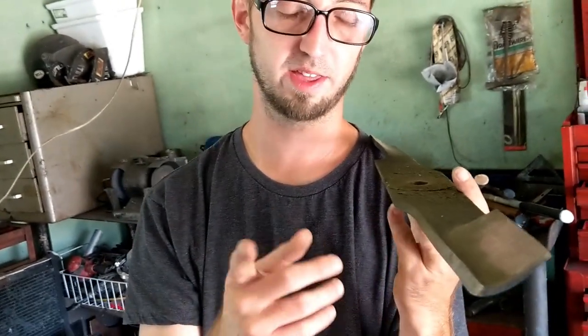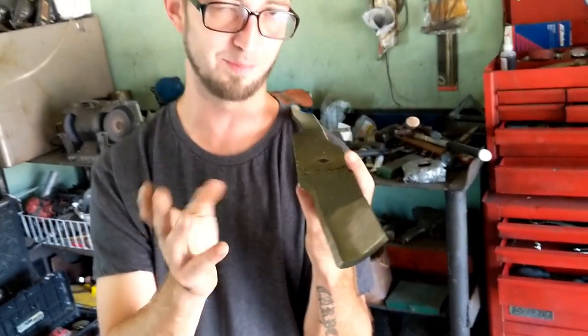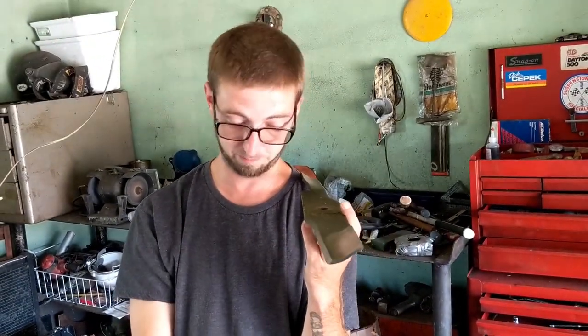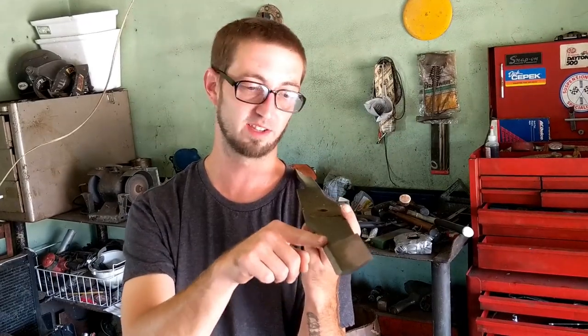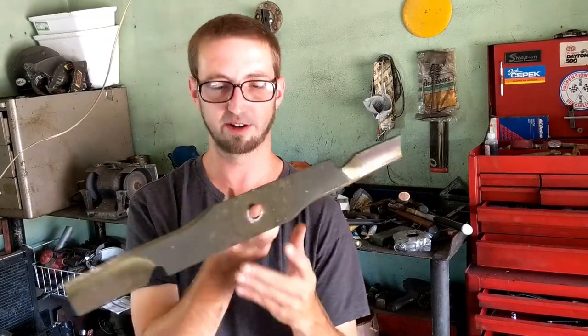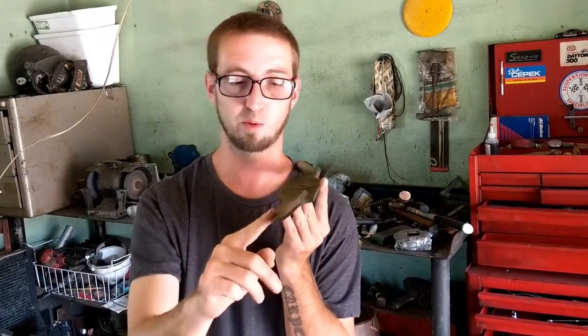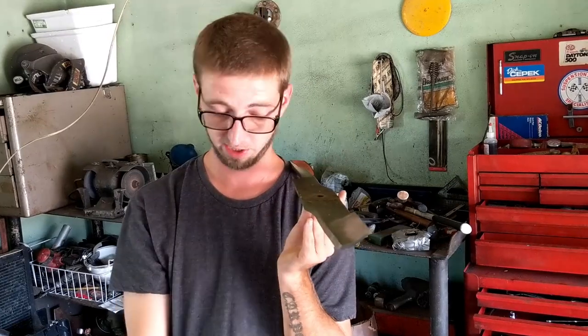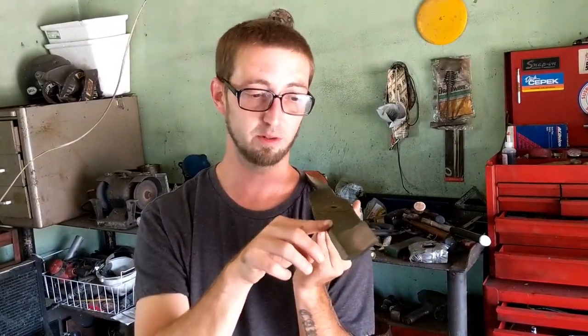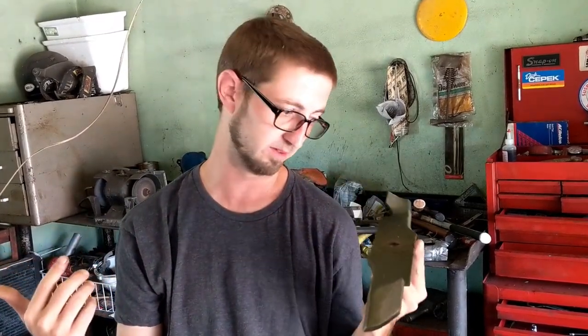Another thing he was talking about earlier is the balancing that he said he doesn't normally do, but that's what this blade is doing for us. It's making this all together, and on this side it'll do the same thing, and then you just find out if it's balanced or not, and take off whichever one needs a little bit more. But keeping a better angle than we do manually pretty much eliminates the reason to worry about balanced blades.